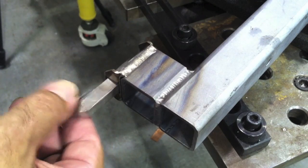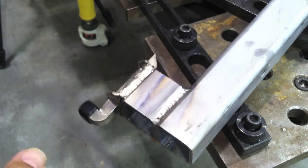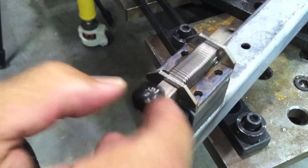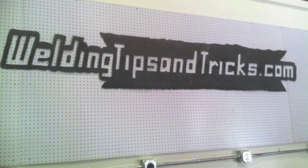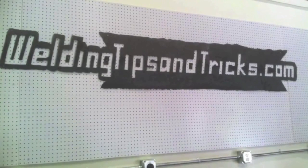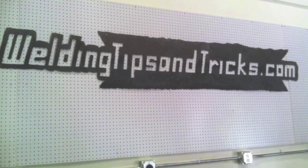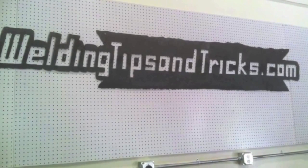Tapering off nice and slow. One concern was not overheating that spring and taking the temper out of it, so I cooled it off quickly after each weld with a shot of air. It didn't discolor the spring - discolored the rest of it a little bit, but not the spring - still got plenty of spring to it. That's the job for today. It was such a quick video I'll actually try to put out a second bonus video this week. Thanks for watching and visit WeldingTipsAndTricks.com.